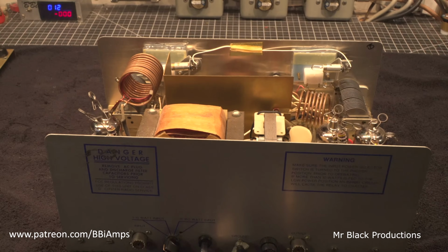I think this is really neat. This is a coupled inductor coil here. This is ground. This is the hot lead on the coax that takes off and goes down. I'm sure it goes to the relay or a switch. This long inductor coil goes off and goes to our taps on our input or in our output section, which we'll cover all that here in a minute.